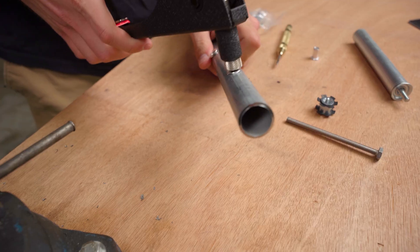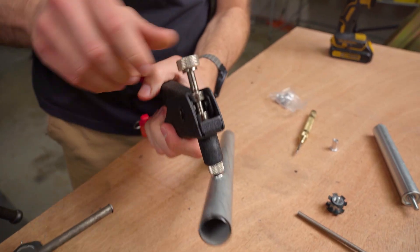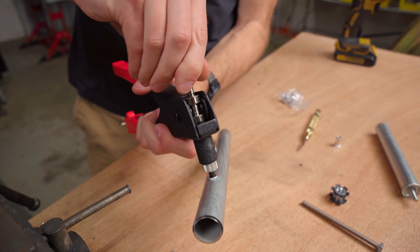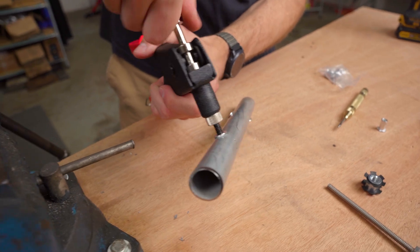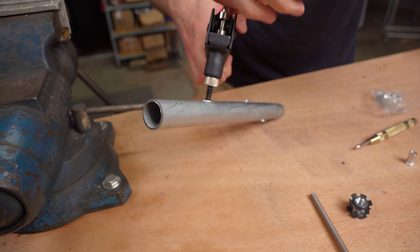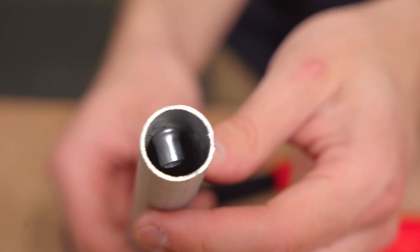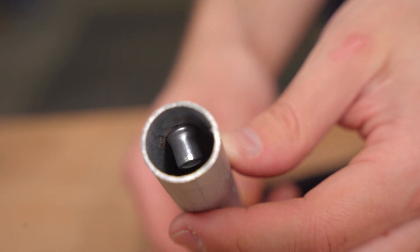What that's doing on the inside — you also have to unthread the tool to remove it, and they have a cool built-in mechanism so you can quickly take it out without spinning the whole handle or the conduit around. Essentially, what this is doing on the inside is adding a knurl on the opposite side, squeezing the conduit wall in between the pieces — and that's what's securing the insert in place.